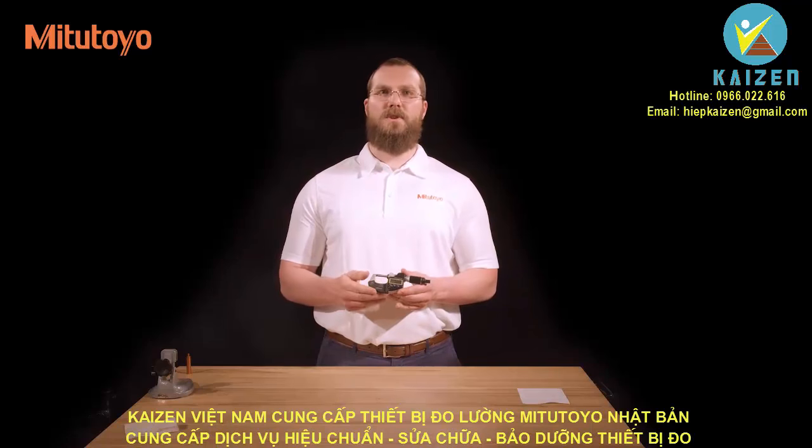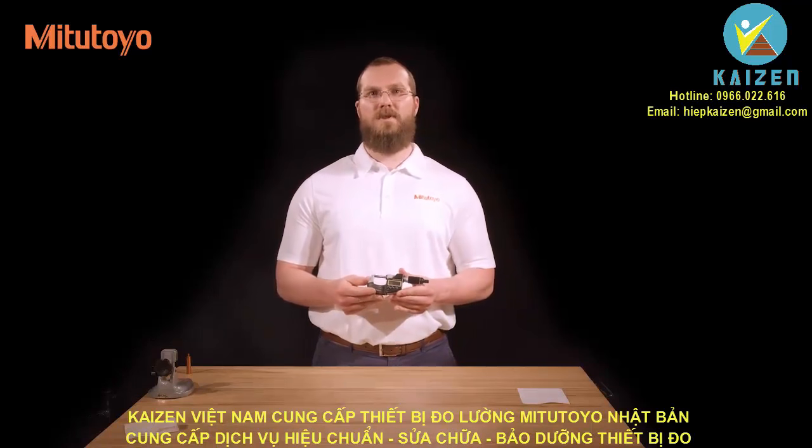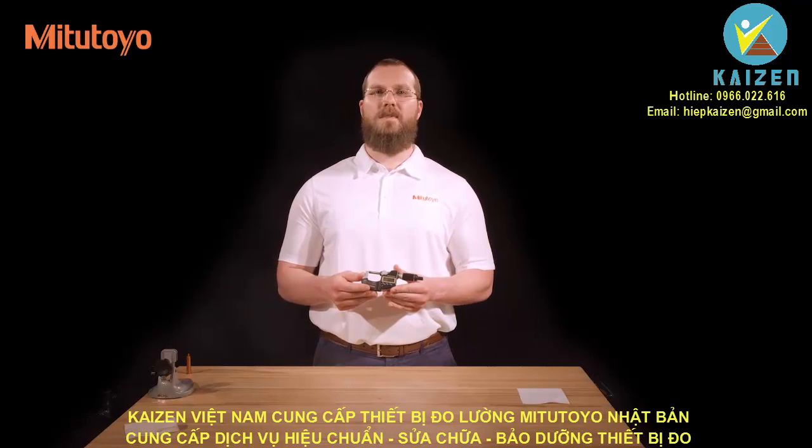You should also check the origin over the course of the day. This is because thermal expansion of the frame can cause the micrometer to give incorrect readings.